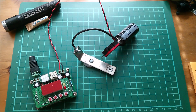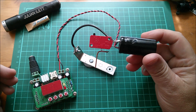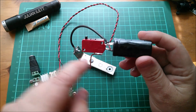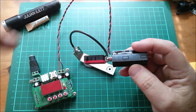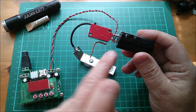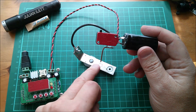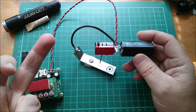Good afternoon all. You join me as I'm about to try an experiment with my experimental spot welding rig. I've got a micro switch here with a 100 farad 2.7 volt super capacitor attached to it, connected to the normally open and normally closed connections mainly for mechanical strength. It's being charged by this power supply. When this button is pressed, the positive will route down onto this piece of copper wire, and the negative is routed around to this steel strip. The idea is to create a current between the copper and the steel to weld nickel strip.